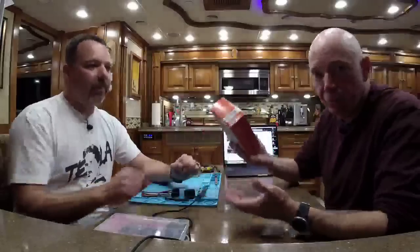So the trick is you have to find a thermostat for your RV that either runs exclusively on battery, and in this case, three AAA batteries. Yep, three. Or double A batteries. Yeah, three AA batteries. Or there are some rare thermostats that will run on 12 volt DC. Unfortunately, the company that made a Z-Wave smart thermostat that operated on 12 volt stopped making them. So you can't really find those. It's kind of glad we didn't put one in then. Yes. Especially if they stopped manufacturing them. However, these are still available. Yep. Very much so. And obviously I bought three of them because, again, three zones in an RV.